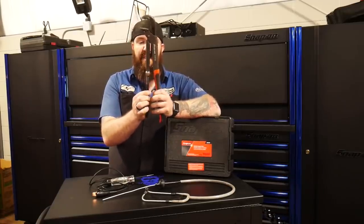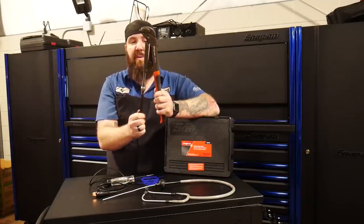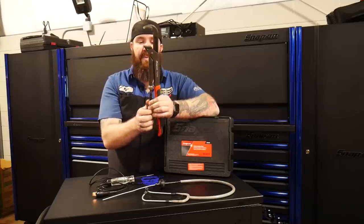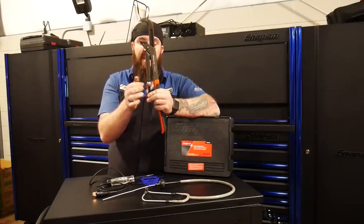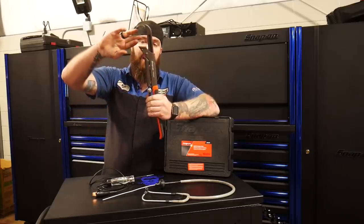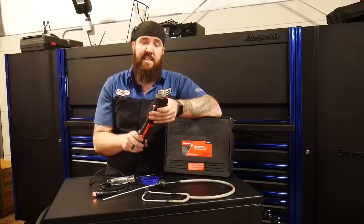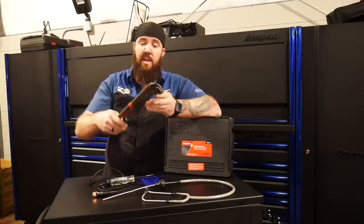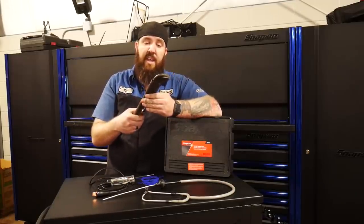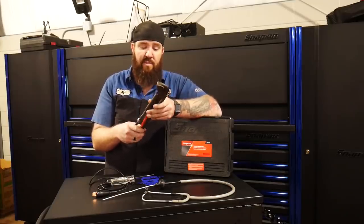The way you work this thing is the adjustment rod right here has a threaded rod all the way down, able to adjust it up. The PWZ2 is able to adjust up to about a 2.75 to 3-inch opening at the end. These are absolutely fantastic when it comes to hard-to-get nuts and alignments. Alignments are the biggest bread and butter for these wrenches.